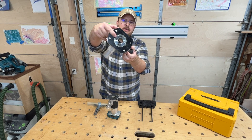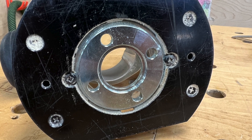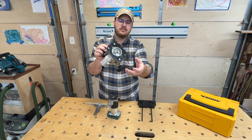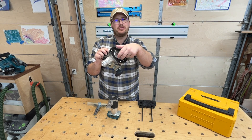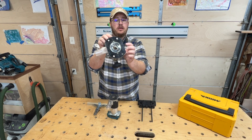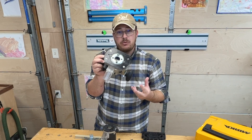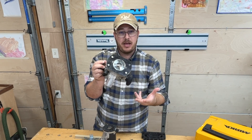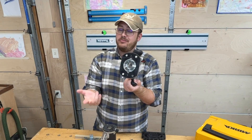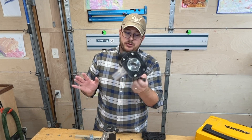On the bottom here, you can see that it has a little silver plate — I had to buy that separately, which is a little ding against this tool — for a router bushing. So if you're doing any template work, you need to get this. They also make some pretty flimsy little metal inserts that pop in here and screw into place. The nice thing, however, is you can take this out so you can really see what you're doing, especially for sign making or using a larger bit. I have put about an inch and three-quarter bit in here to do some work before.